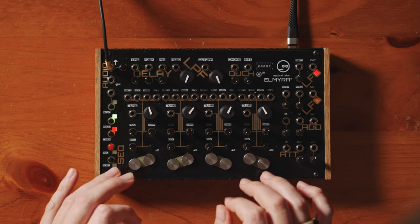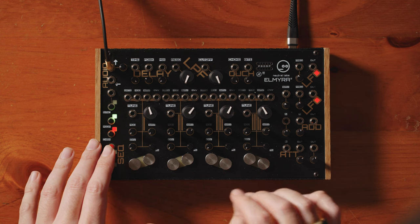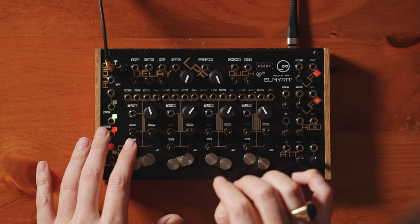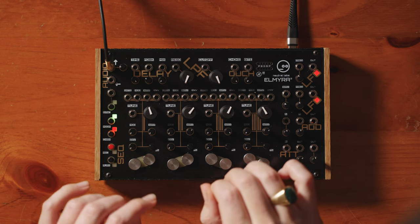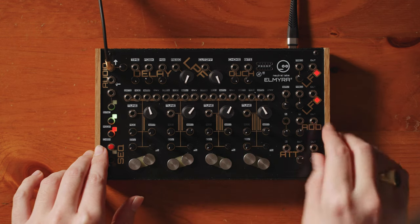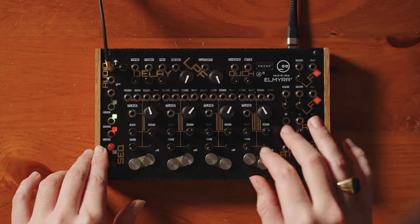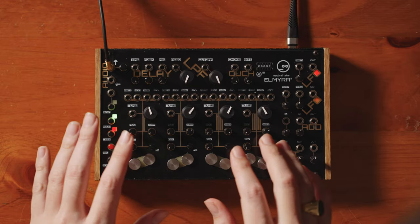What that means is that if I try to use the Elmyra with my Buchla 245T, I would have to be very careful in putting the pitch, since the sequencer goes from 0 to 10 volts. And while I would not damage the Elmyra, I would max out the tuning knob about at a third of a turn. So yeah, your mileage may vary. And again, you wouldn't be breaking anything. It is just you would have to be very precise using external sequencers with this. But I don't think that's the point of these.